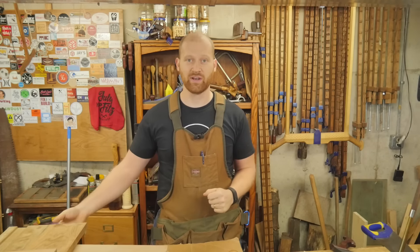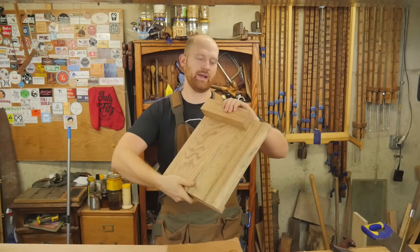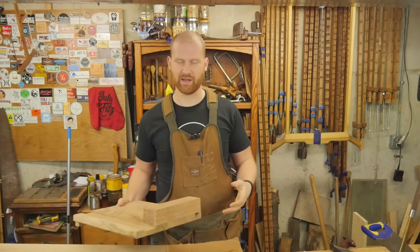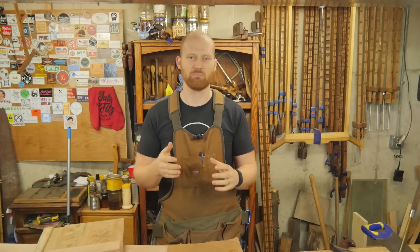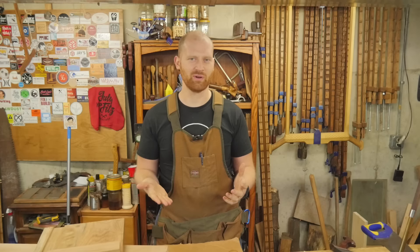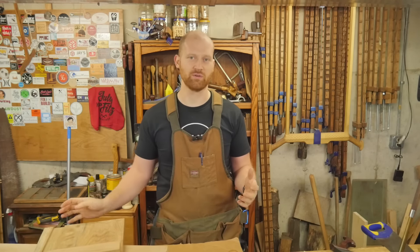For this next week, I have a few videos coming out. I've been wanting to do a new shooting board for a while, so I'm in the process of finishing this one up. A shooting board is a fantastic way of squaring up the end of a board, shooting off the end, and making it perfectly 90 degrees — a really nice tool that most everyone should have, even if you run a power tool shop.